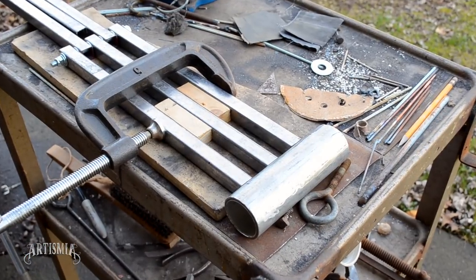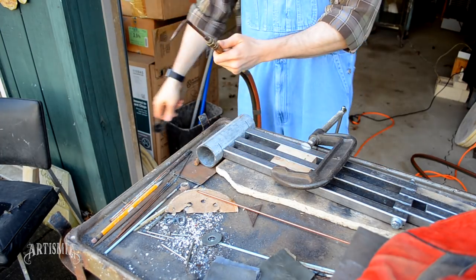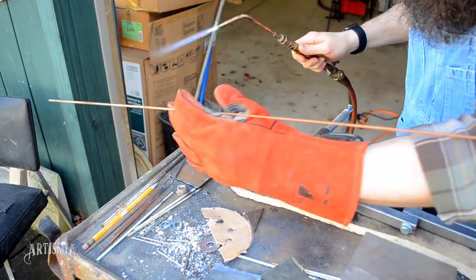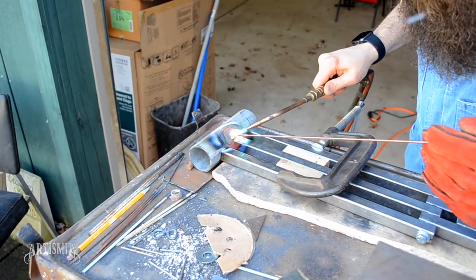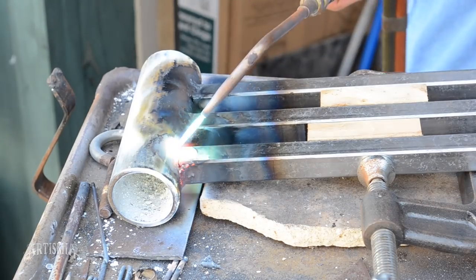Always make sure you have proper ventilation when welding, especially galvanized steel. When zinc vapors mix with oxygen in the air, it instantly becomes zinc oxide. Prolonged exposure may cause one to feel ill, similar to the flu. This is also known as metal fume fever, and will usually go away on its own.